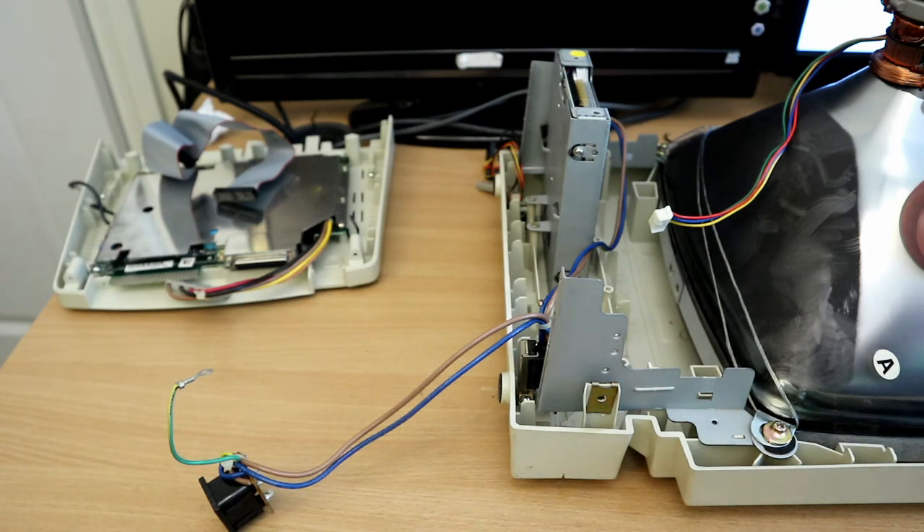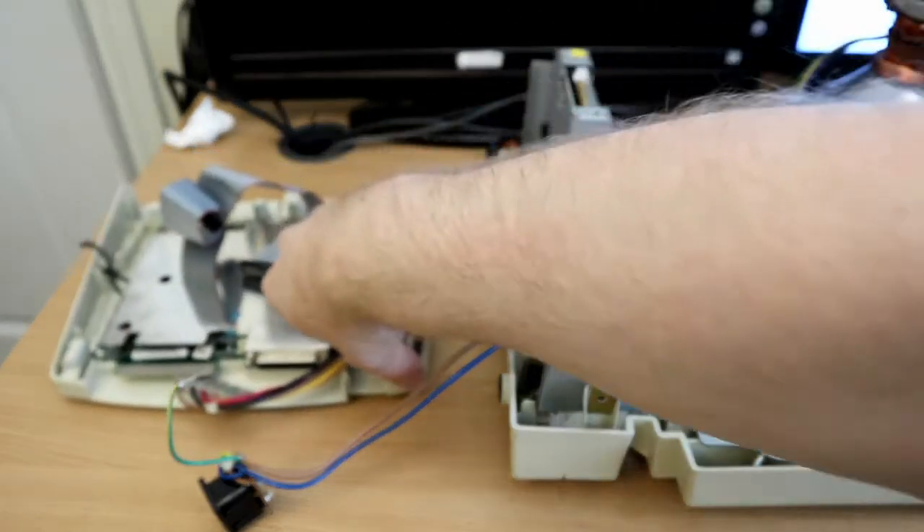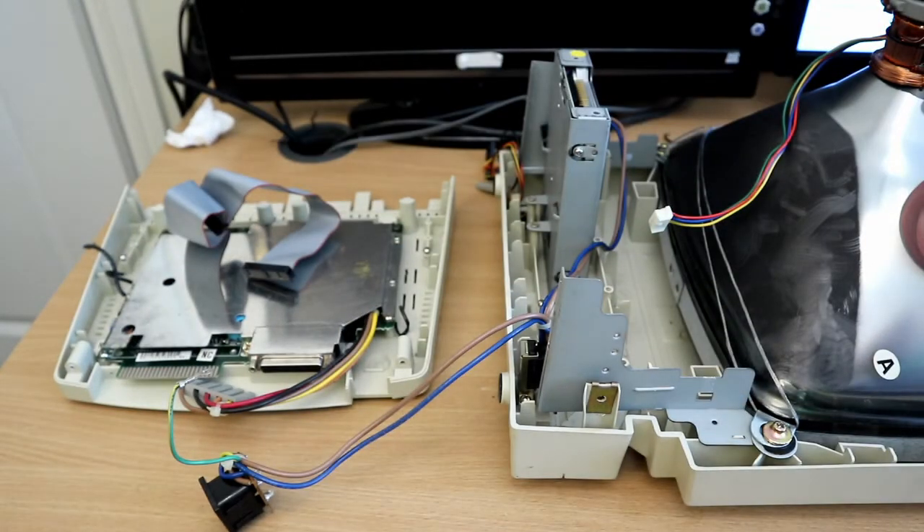The boards are back in, and just for giggles I did test the capacitors that came off. Two of them were fine — perfectly within spec. One of them, the one showing all the signs of leakage, had completely failed. It wasn't even registering as a capacitor; the testing unit was just saying unknown or broken part, so it wasn't even trying to do anything with it. I can't guarantee that was the only fault, but it was definitely a fault and we found one — that's better than finding nothing.